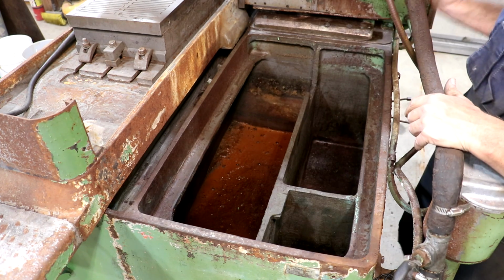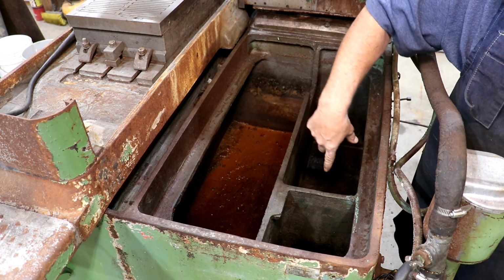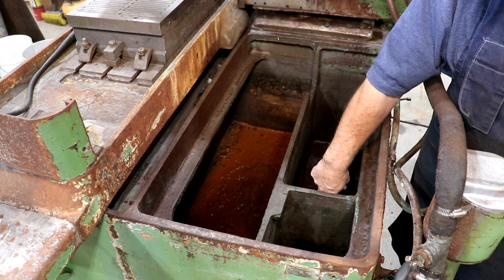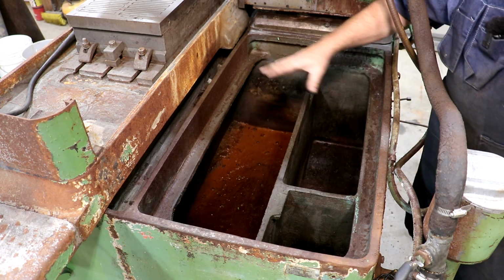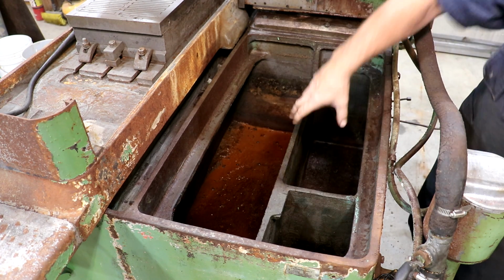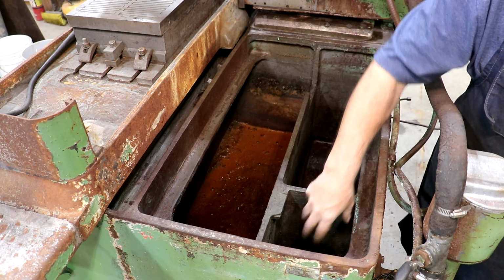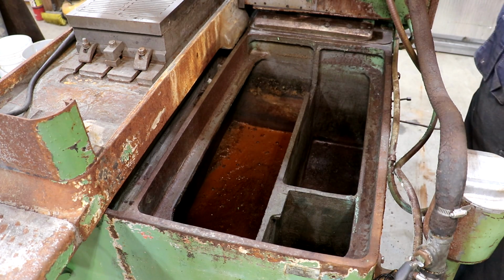And this tank has a separator here. This is where it actually is pumping out of, but it's open in the bottom. Basically, you usually have a bunch of crap that's just floating up here on the top. That will keep that stuff from floating over into the area that you're pumping out of. So you've got some separation going on in here.